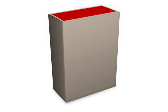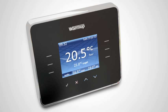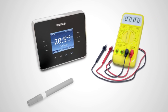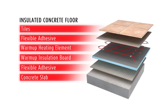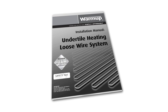In your Warmup pack, you will find the loose wire heater, an installation manual, floor primer and a roller, and tape to secure to floor. Before beginning your installation, make sure you have a Warmup thermostat with floor sensor, a digital multimeter, a permanent marker, measuring tape, and a hammer and chisel. Also, make sure you prepare the subfloor to British Standard guidelines. Further help with floor preparation and tile application is available in the installation manual.